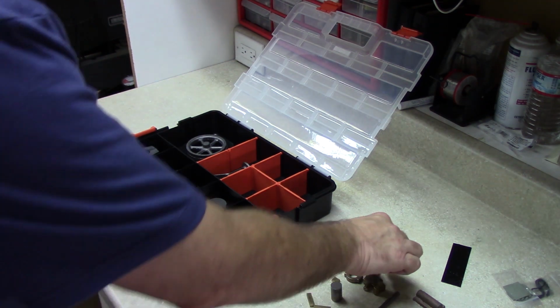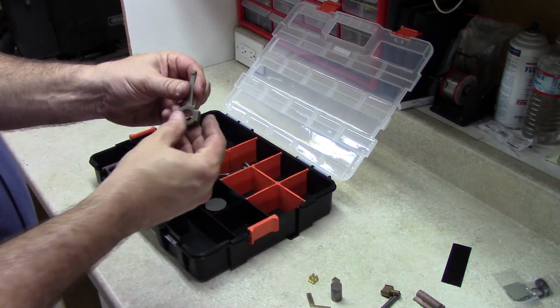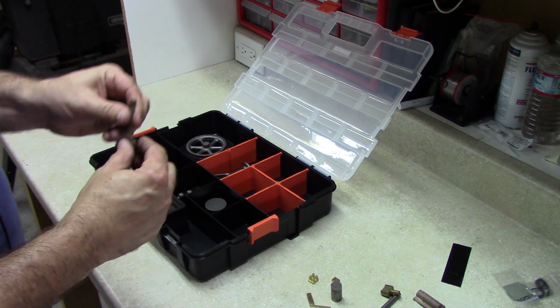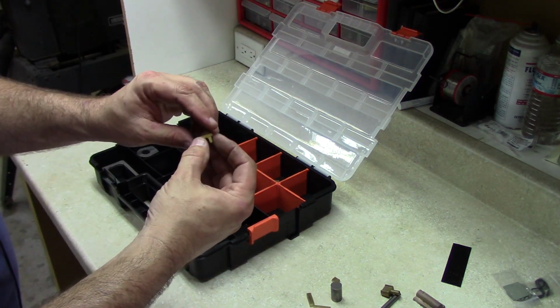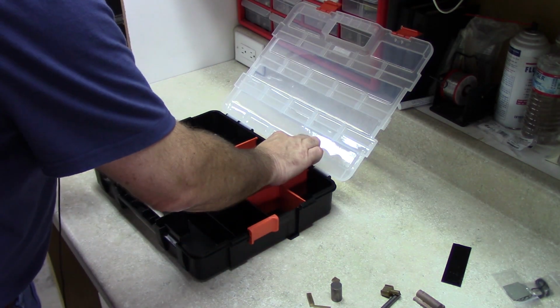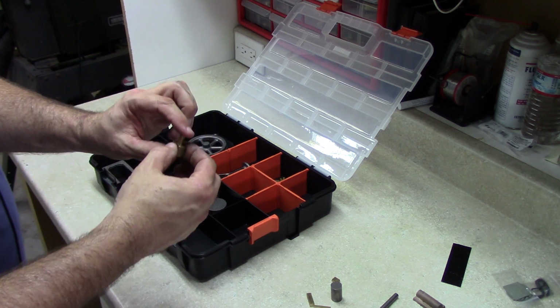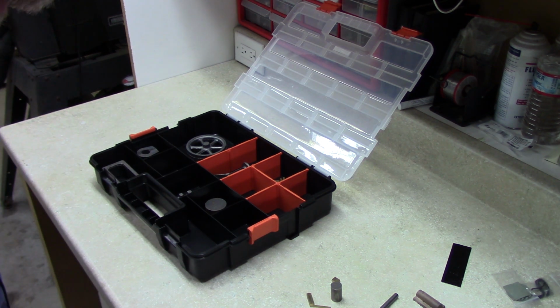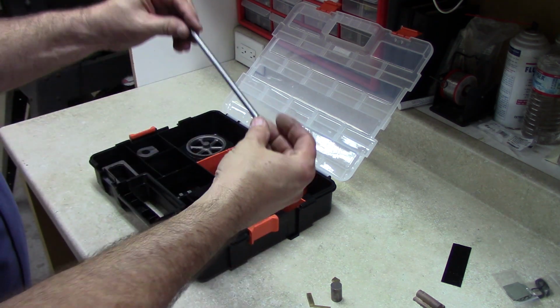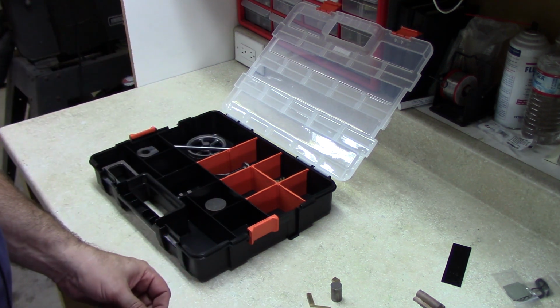The connecting rod, the picture that appears to be here, is a brass casting. The eccentric strap, this will go through and hook from the eccentric and drive the valve mechanism. The slide valve itself, very small little piece. And the crosshead that connects from the bottom of the piston, where the motion needs to be linear, to the connecting rod that will be swinging back and forth as the crankshaft rotates. The crankshaft, they note, is a large piece of steel rod. That'll fit there.